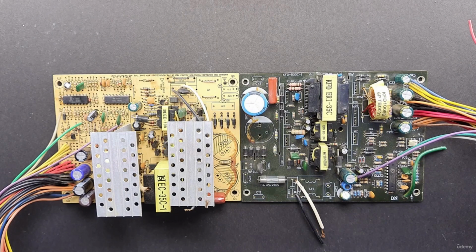Another method often used to troubleshoot electronics is to swap a known good component for the suspected bad component. Keep in mind that the good component could get damaged in the substitution process. Don't get into the habit of substituting parts if you are not sure whether the component is faulty. This method works best when you have narrowed the failure down to a specific component. We will learn about testing each of the components individually in the upcoming lectures.